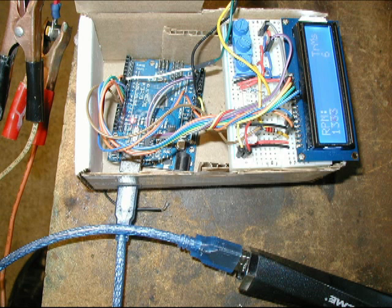Here's another view of my version 2 Arduino controller. This one shows the Uno down inside the cardboard box. Note the twisted wires coming from the CNP pack and the twisting of the leads coming from the Arduino and going to the LCD. This technique also helps to minimize the negative RF effects on the Arduino. On this system, I have shortened the wires, removed most of the alligator clip leads, and cleaned up the wiring considerably from my version 1 setup.